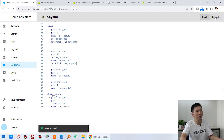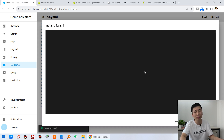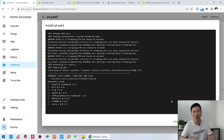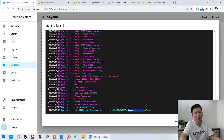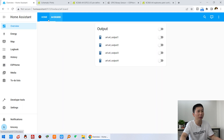Press install, download firmware via this USB cable. I'll wait a moment for it to compile and download to the ESP32 board. The download is now complete and it has connected successfully with Home Assistant. I'll click stop and go back to the dashboard.